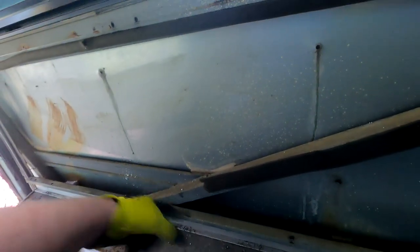When I came down on Tuesday I drilled out all of these rivets here. It turned out there was a lip — you can see it better here — which was riveted to the framing members, as you can see by the rivet holes. This morning I tried to drill those rivets out but the heads just kept spinning, so I took the grinder and just cut them off. Easy — took no time at all.